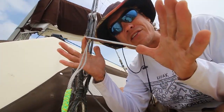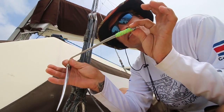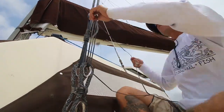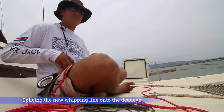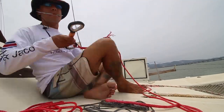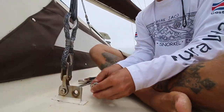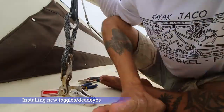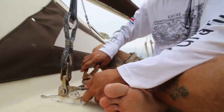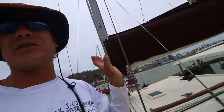If you don't have one of these, this is a Meyerchen marlin spike — contact Luke at Kraken about getting yourself one. He even puts a Dyneema lanyard with a Turk's head knot on it. Very cool. Now that my whipping lines are set up I can start installing this stuff. If you don't know how to do this, refer to my other videos. That's set up — that was easy. Now we just got to splice this; we need to measure five feet from the top.